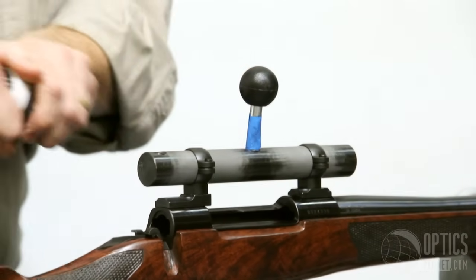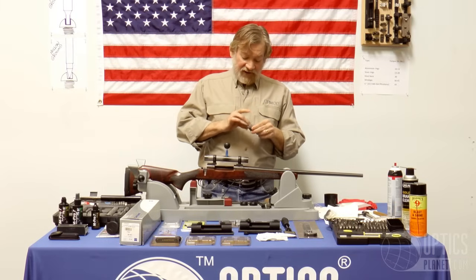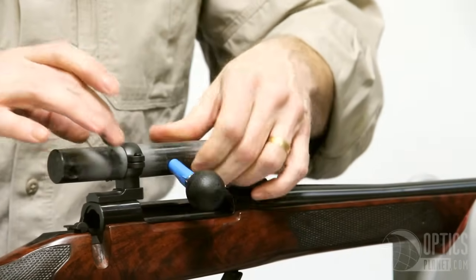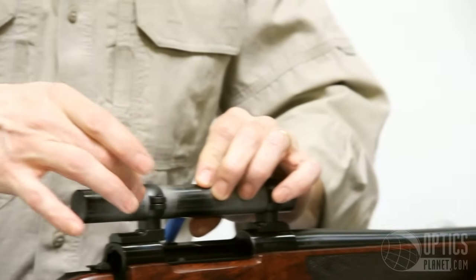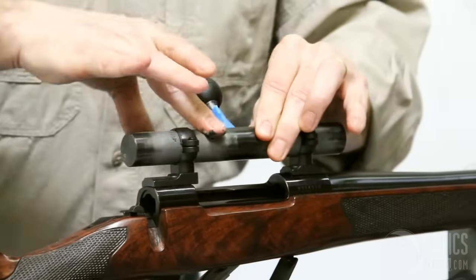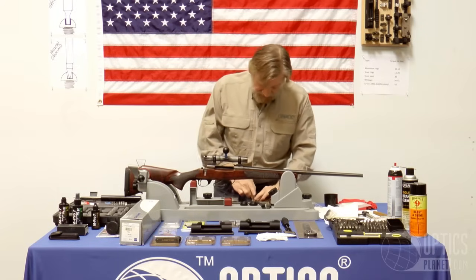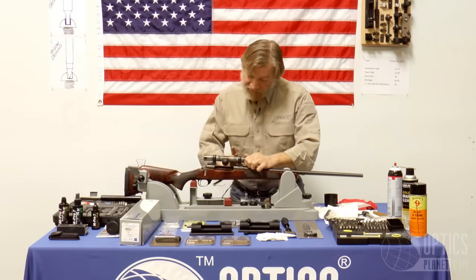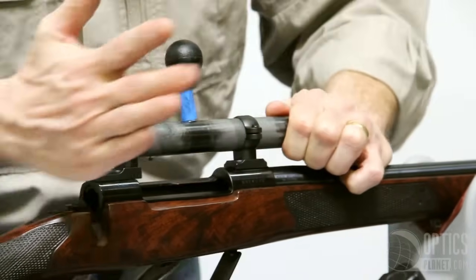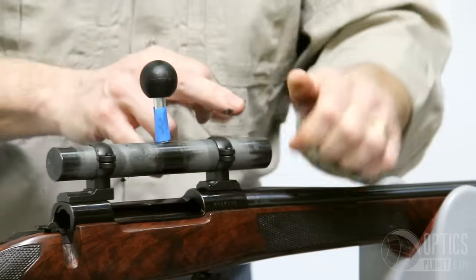Now you could use your 220 grit lapping compound. And this is very, very messy. It'll stain everything like crazy. So watch what clothing you're wearing. Have a garbage can with a bag in it, maybe, to throw your stuff in. You can pretty much liberally apply it. You don't want to put all that much on it, because then you just have to clean it off when you're done. And it's pretty messy. You don't want to drop any of this in your action. And you can leave your jug open because you're going to be using it for a while.